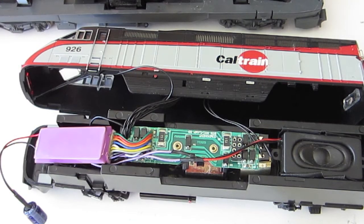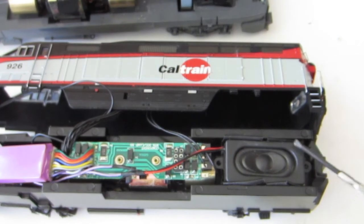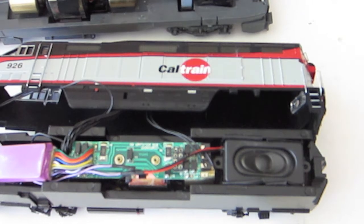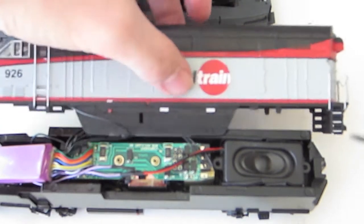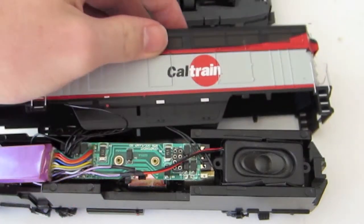Alright guys, here is the basically finished product of the installation of sound into a quick plug Athearn locomotive. Basically I've mounted the speaker from Uralic Models here. This is not the completely shaven down one. I'll put in the description or the video what speaker this is. But I've mounted it to the frame using electrical tape, taped to the back and then looped over to be double-sided tape basically. So it's not going anywhere. I have it facing up because below it there's more of a baffle, and this has a see-through grill which will spit out that sound like nothing, right?